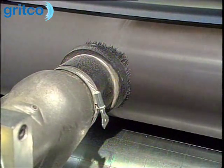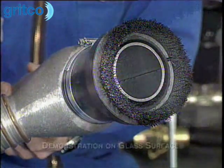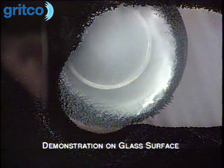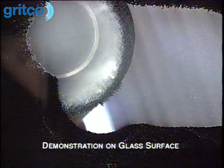The brush is actually a combined blast and suction head. The inner nozzle directs the pressurized air and Armex mixture onto the roll. Simultaneously, the outer ring creates a vacuum which is used to remove the spent media and contamination away from the roll.